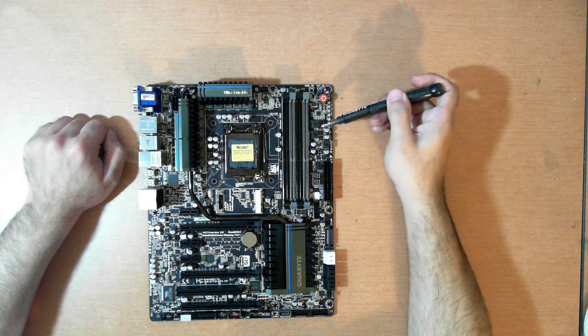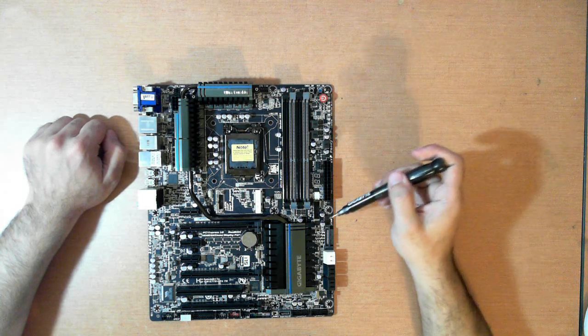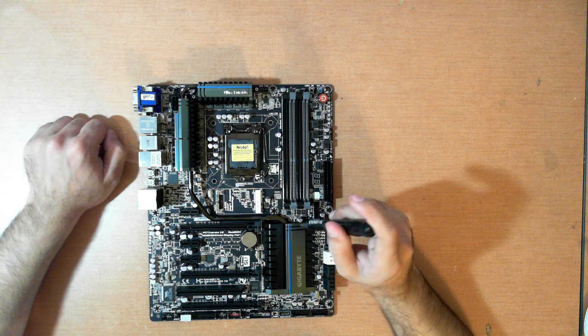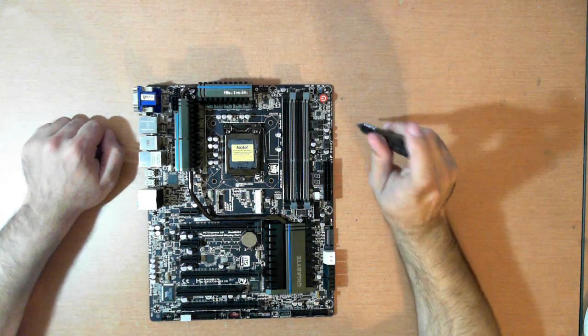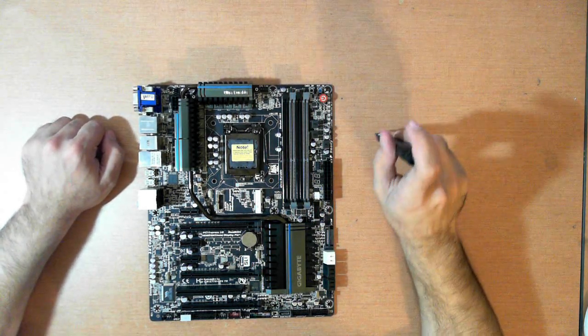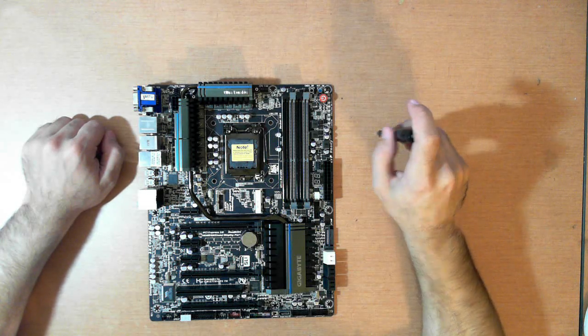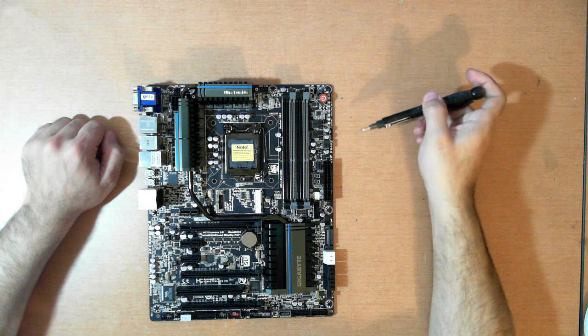It also needs one other separate voltage rail for this, and it might need another one for this. Well, it of course needs another one for this, which is for the PCH, right? So that means in total you need at least 5 outputs, okay? And most PWMs are dual output PWMs. However, this PWM here is not a dual output PWM.